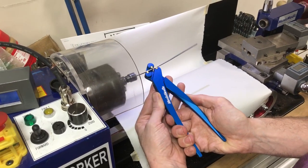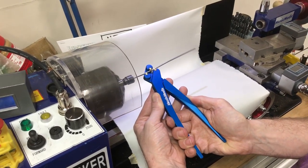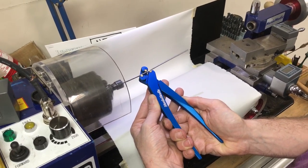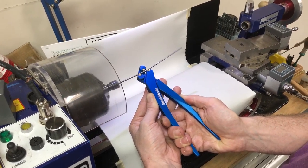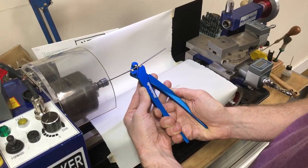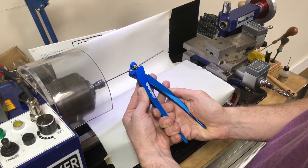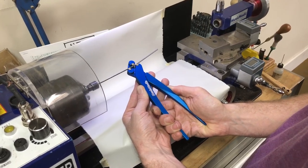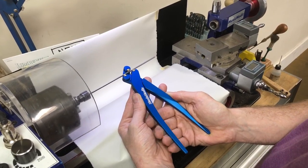Ryan's using a fairly light grip — on a scale of 1 to 10 he's probably gripping it about a 3 or 4 — just keeping the jaws closed around the rod. He's moving from left to right, and you can see that just with this motion spinning at a low speed, you're able to very quickly take the bend out of a rod.